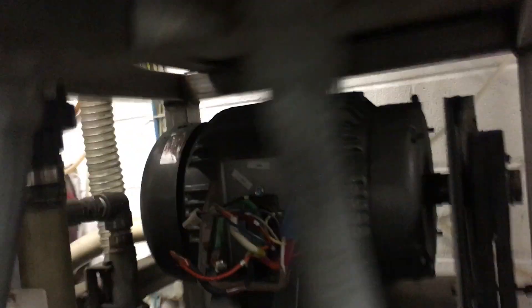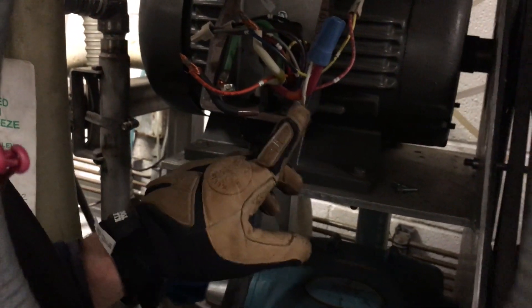6 and 9, and then you had 4 and 7, and 5 and 8. If you look on that metal diagram I just had — the cover — it was 6 and 9, 5 and 8, 4 and 7. So you can see right here that your white, you're just going to have one wire to your large conductor coming up, feeding from the disconnect, your line in.